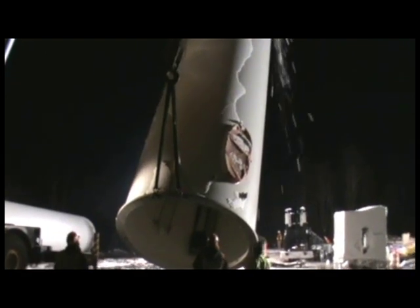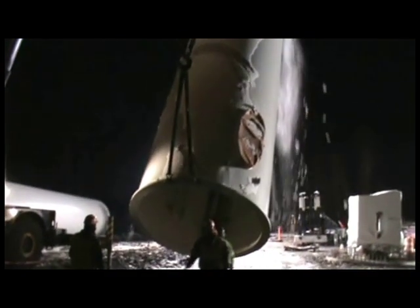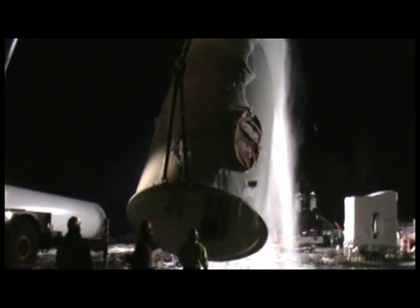The two 18-ton tailing brackets weigh approximately 36 pounds each, with eccentric inserts for adjusting hole patterns. The SlingMax TPXC 4000 x 10-foot slings are used with Crosby S252 20.5-ton web slingsaver shackles.